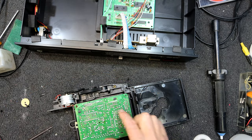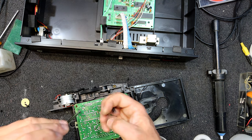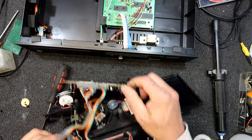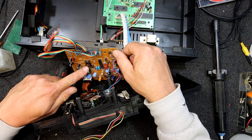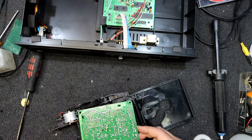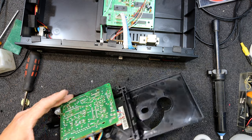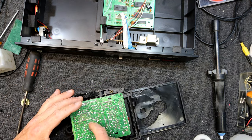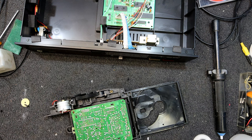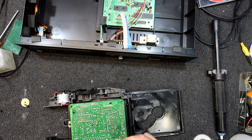I've got a few potentiometers here. Probably should have a look to see if they were labelled on the other side because they're not labelled on this side. Weather there - focus offset, tracking offset, something like that. Probably there's laser power - it says labelled laser and that's labelled focus. This laser doesn't have a laser power trim pot on there, so that must be the laser power, and that one over there is something to do with focus.